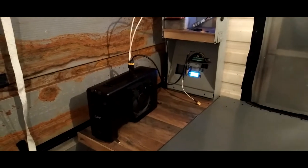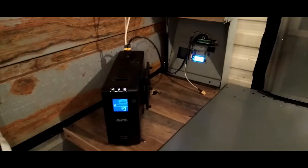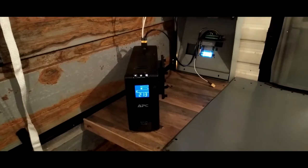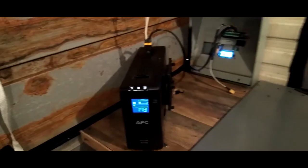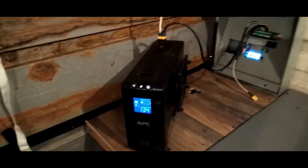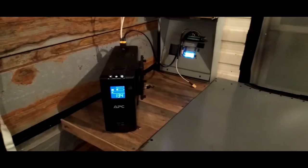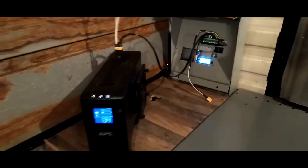Basically, what we're gonna do now is disconnect, because right now I'm connected to house power for the lights and stuff. So we're gonna disconnect everything and run a few items or tools that I do have that it can handle. This system actually works with a 12-volt lead-acid battery, so the voltage difference is one volt. It's actually supposed to be at 13.89 volts, and I'm only charging the batteries up to 12.3 volts. That's what I got the buck converter set for. Fully charged, the battery pack is 12.6. So just keep that in mind.